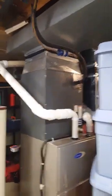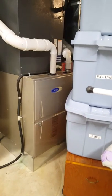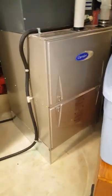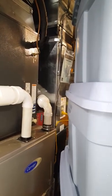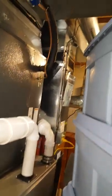We're going to replace the AC system. There's a newer furnace already in place, so we'll leave that as is — two-stage heating, variable speed motor. We're going to put in a new thermostat, a Vision Pro 8000 with the interface module, to control the staging. We'll hook up two-stage cooling and two-stage heating to the interface module, along with the humidifier that's already in place.